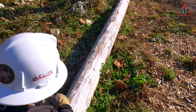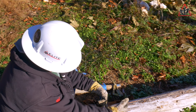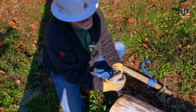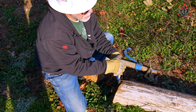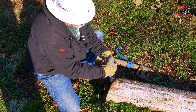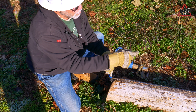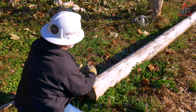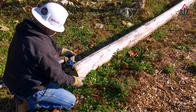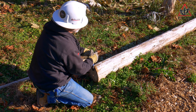Normally you do this operation with two men. What we would end up doing is I would pull the pole ground tight, then the next man, about six feet up — I have a staple in the pole already set — and they would go ahead, once I pull tight, they would go ahead and set the staple. What that will do is from that staple to the top of the pole, our pole ground would be very tight. So this is the basic lineman skill that they're taught on how to pull a pole ground.